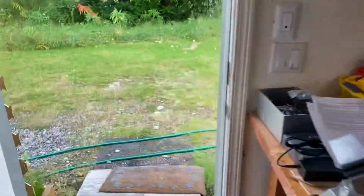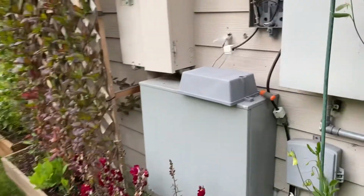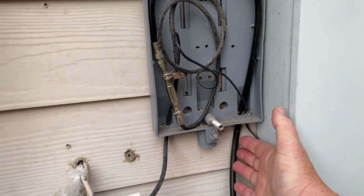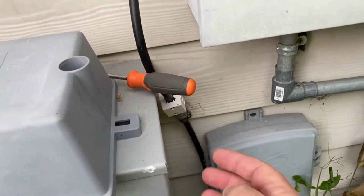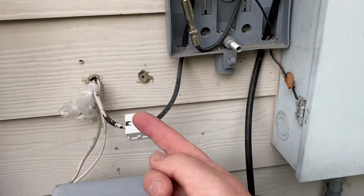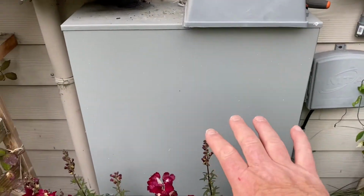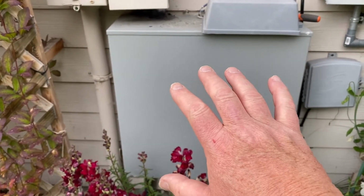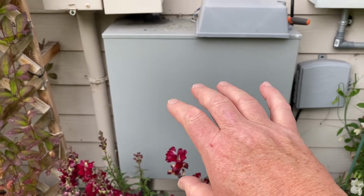Anyway, if you come outside here, excuse the mess, workshop, what we've discovered is my cable company imports its signals through this coaxial cable and into my system, and I've got various chokes here to try to stop the common mode noise coming up or down the coax. I've got a whole house AC two-phase noise filter system in that box, each rated at 200 amps.